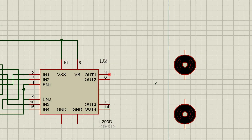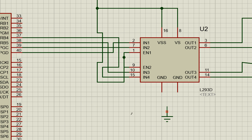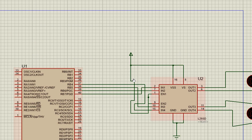For the outputs: connect output one to one motor terminal and output two to the other terminal. Similarly, connect output three and output four to the second motor. For the ground pins, use the simulated ground from the terminals. In reality, you have four grounds — short them, one ground goes to the common circuit ground and another goes to the ground of the VSS power source. Two grounds connect to the VSS power source and one to the microcontroller power source.